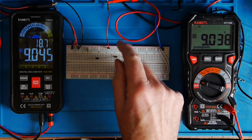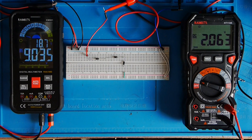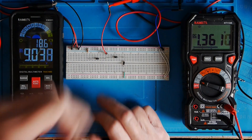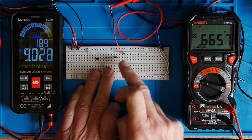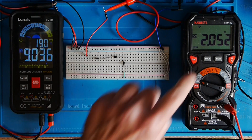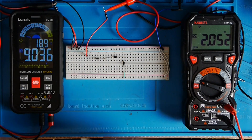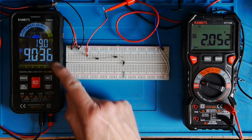I've got the meter attached to the supply rail. Dropping it onto the junction between the 1k resistor and the first diode, we're getting just over 1.3V — that's your forward voltage drop. Above that last diode, 0.66V — just the forward voltage drop from that diode. So going back to the junction of the 1k resistor: we've got two volts there, and this circuit, although very similar, behaves in a slightly different way. Before, the change from input to output voltage was proportional as we dropped the input.